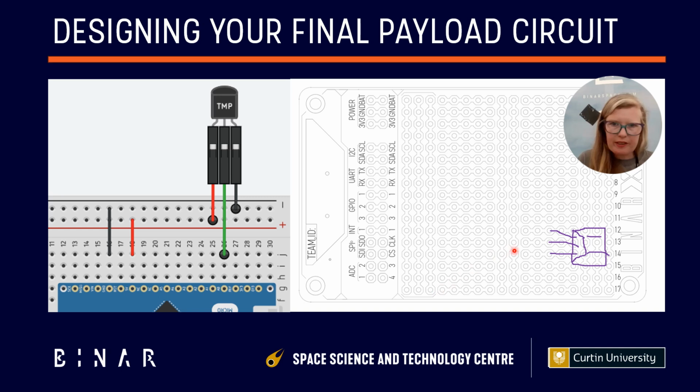So the first thing I'm going to connect is the voltage. We're going to go just like we did in an earlier example, but I'm going to use the power rails in this case. So in the middle here, I can use these. Then I can say, okay, we're going to travel up, up, up, up, up, and I want to go into 3V3, so I'm going to come from this one. That would be my solder point there, and then I would come across here and solder to one of the 3V3 connections there. All right, and then the next one I want to do is the ground. So there again, I'm going to bring the ground one. Which one's my ground pin? It's this one.